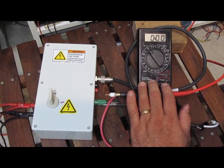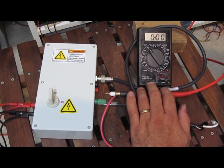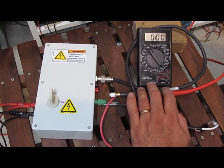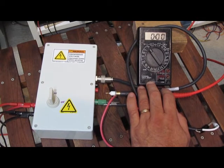A couple of things I'd like to mention about specifications. I'll just read what it states here: if control of transient overvoltage is employed in the measuring circuit used to measure mains, any overvoltage limiting component or circuit shall have adequate strength to limit the likely transient overvoltages in normal use. Conformity is checked by applying five positive and five negative impulses with applicable impulse withstand voltage of Table 102, spaced up to one minute apart, from a hybrid impulse generator — see IEC 61180-1. If you're interested in building your own generator, I would suggest IEC 61180-1.